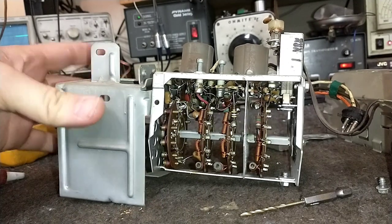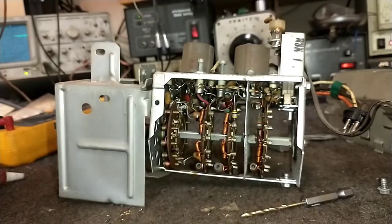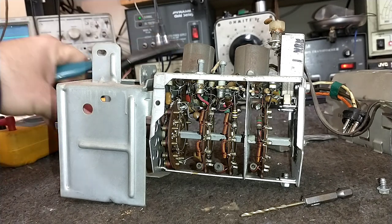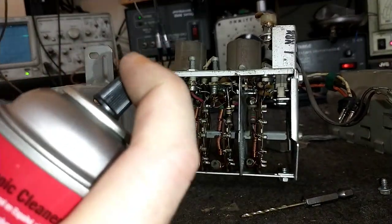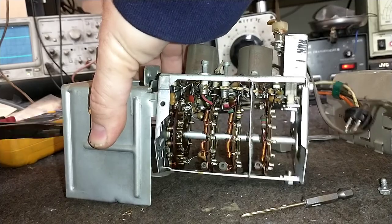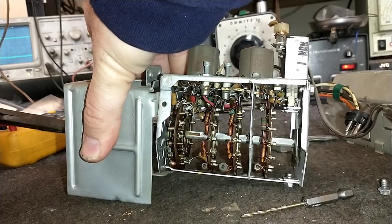What we're going to do is clean the contact plates using CRC-QD because it doesn't leave residue and it's fast drying. I don't use DeoxIT on tuners if I don't have to — I find with these old tunable slugs that the DeoxIT will settle inside and actually change the reactance enough to where your tuner will drift and detune. So I'm just going to grab hold with the duck-bills, spray on this contact plate, and rotate through its positions.